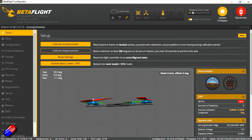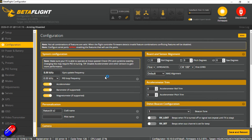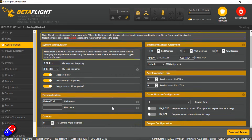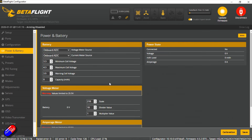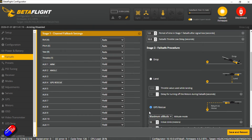There is data in the flash memory — this has been armed before shipping, which I love to see. There are loads of UARTs available: GPS is set for UART3, ESC telemetry is present, and the receiver is on UART2, operating as a separate ExpressLRS receiver. The gyro and PID loops run at 8K with only 27% CPU load — this H7-based processor handles that easily. Failsafe on this unit, even though it doesn't ship with GPS, is set to GPS rescue, which I would recommend.